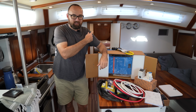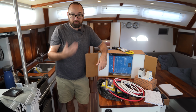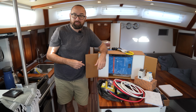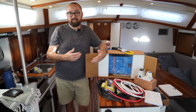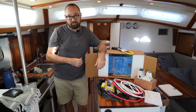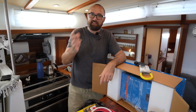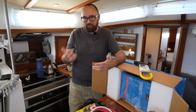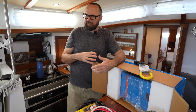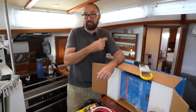But here on the dock, we're getting not 115, not 120, but 130 volts, meaning on the secondary side, the output side of the isolation transformer, we're seeing above 270 volts, which is outside of the voltage range for our inverter charger. I am expecting this to be much less of an issue once we hit the United States, because at least I'm assuming the grid there is a little bit more well regulated than down here, where it's a little bit more like the Wild West, because we're seeing pretty significant fluctuations in voltage here.